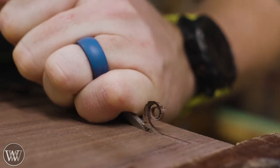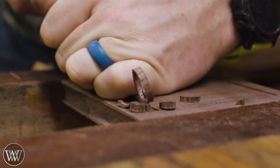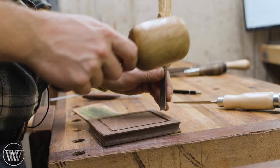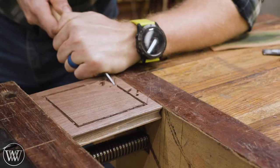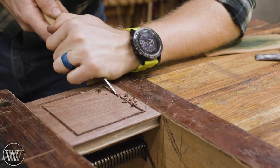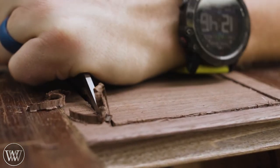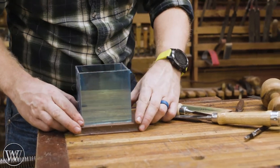It's times like this where you get these perfect little curls — this is why I do hand tools right here. Once we have a groove all the way around, we can start putting the box into place. This was a little bit tricky; I had to work on it back and forth and actually had to widen the groove a little bit at some points. Back and forth between cutting the groove wider and working on the box got it to fit down in there. In one place I actually had to trim off the box a little bit — very scary to do, but plexiglass planes really well. If you have a nice sharp chisel, it will carve it down. So once the groove is down to depth, make sure it fits, and then adjust the plexiglass a little bit to fit in there.